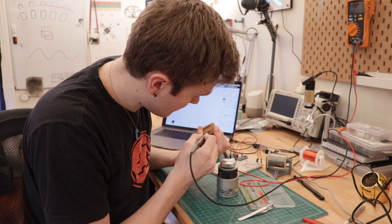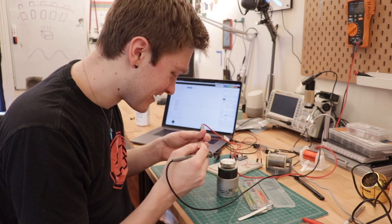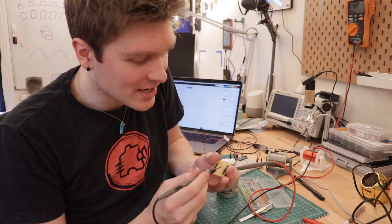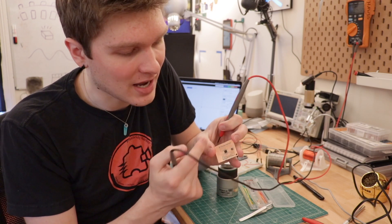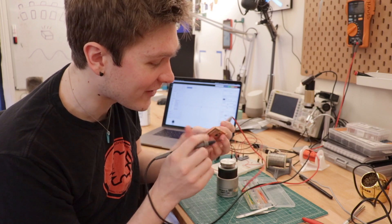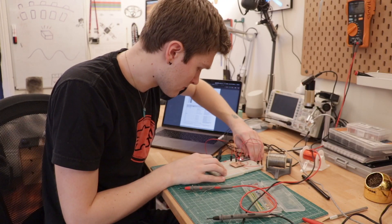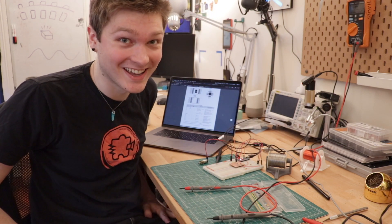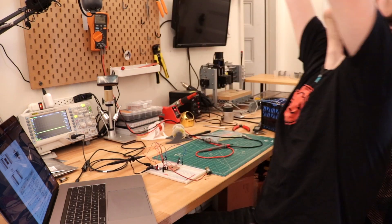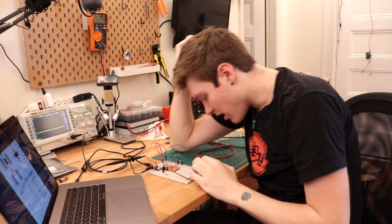Well, there it is — that's crazy. That is the jankest thing I've ever done. I thought I was going to have to solder a wire from the bottom pad to an extra pin, but instead I just soldered it to the main copper plane that doesn't have a dedicated trace. Now the whole surface is connected to the bottom pad, and I just shorted this big ground plane to the ground pin. I can't believe that worked. It still didn't fix it though — turns out the motor driver's feedback current-sense pin also can't be left floating; you have to ground it. Once I grounded it, everything worked. Thank god — the chip wasn't blown.